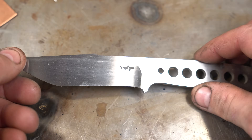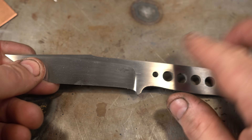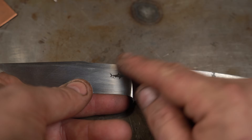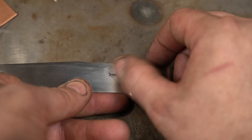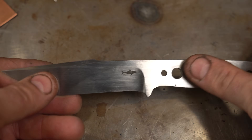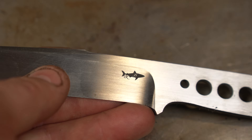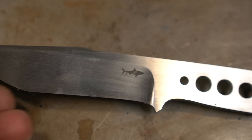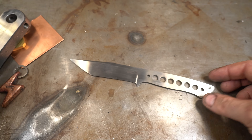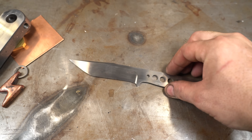Finally, I did a knife in hardened steel — 100% power, 100% depth, four passes. It's as deep as my electro etch and really crisp. I'm going to be stone washing this knife so I needed it nice and deep. That's on the 4k setting and I'm really happy with this laser. I'll honestly be throwing away my electro etching stamps and going with this permanently. Huge success.